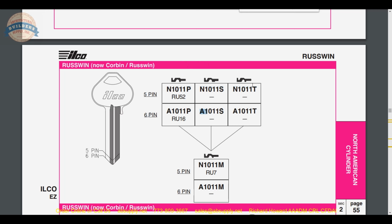If you had a three-story building, an architectural firm, a design firm, and a law firm, the owner could walk around with the all-section blank and pass all of these different floors. But the keys from the first floor not only will they not work in the second or third floor, they won't even enter the cylinder. They won't even go in. And vice versa, from the second to the first and third, and from the third to the first and second. So these cannot even pass each other. That's a common usage for multiplex.